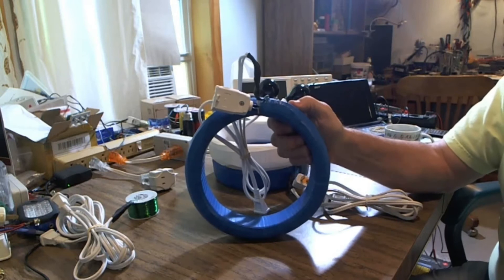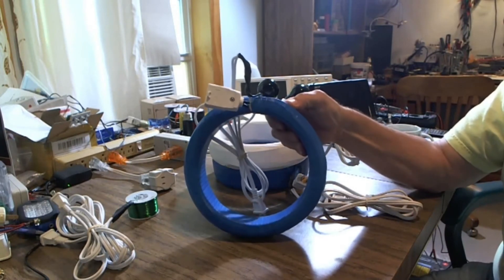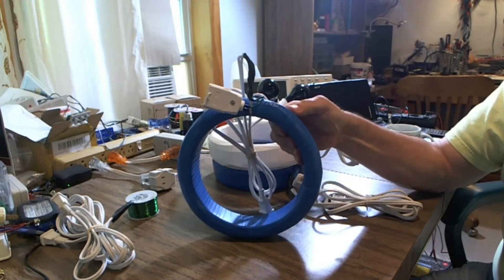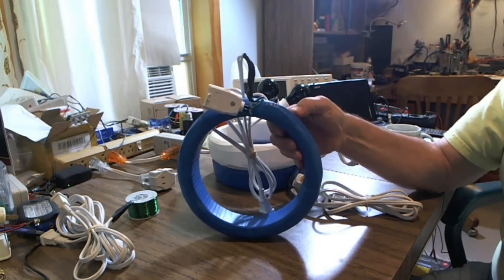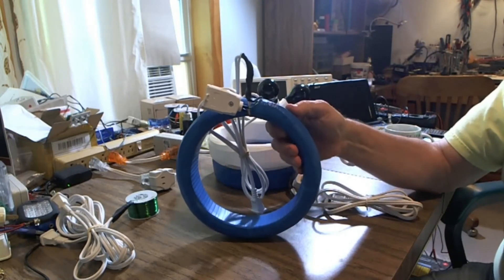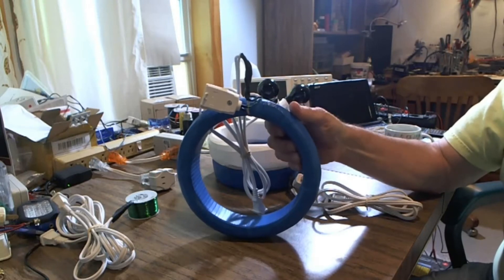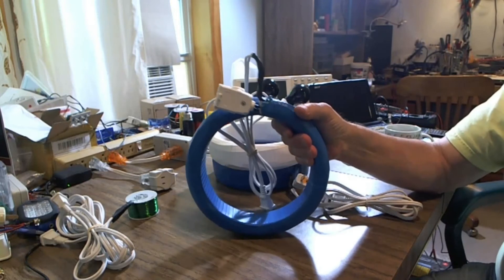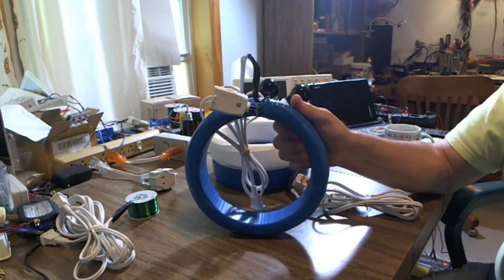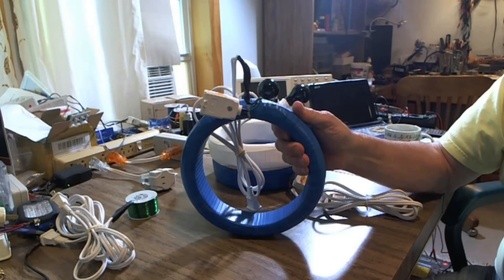This coil uses 168 to 175 feet of wire. The small difference isn't that critical. I experimented with these units all the way up to 250 feet of coiled wire, back down to 200 feet, then down to 185, trying to trim and find the length that worked best — a compromise between a lot of different features. A friend and comrade out in Oregon originally prompted and inspired me to make these units, and he came up with 168 feet. Sure enough, I found that worked the best. So I'm now making all my new coils at 168 feet.